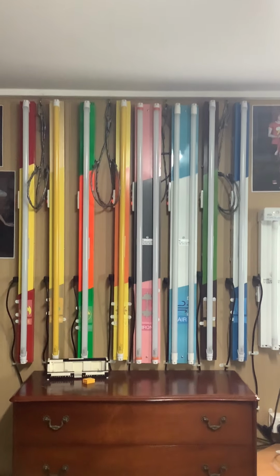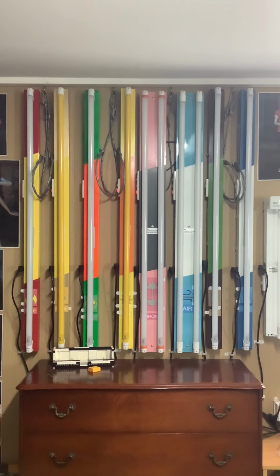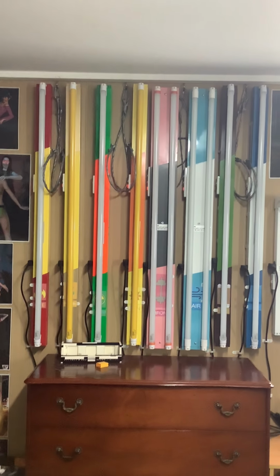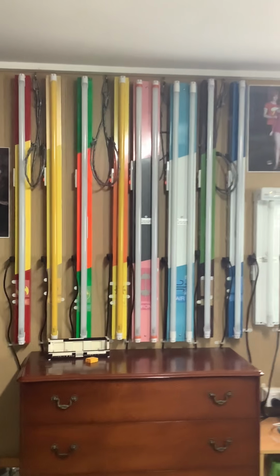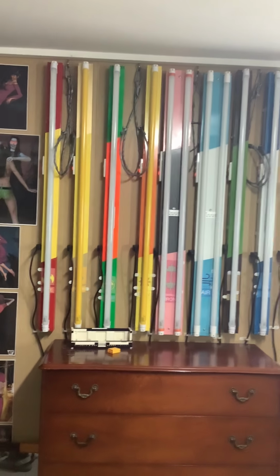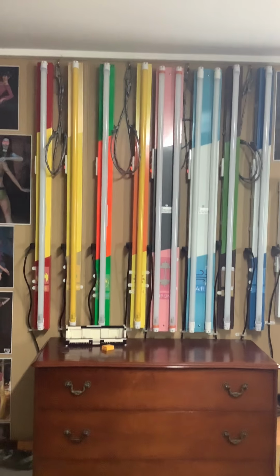Now the history of these is you did have coloured fluorescent lamps in these, but now I've got LED coloured tubes. I've upgraded all of these to run LED, and they are for LED only, as I've taken the ballast out of them. Now you might notice that you can't see any starters. That's because all 8 of these have concealed starters. The starters are hidden inside the chassis. So to replace them, you just undo the plate and then you can take out the starter and replace it.